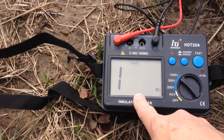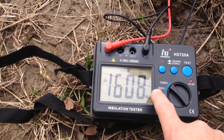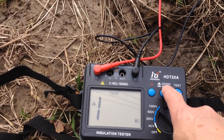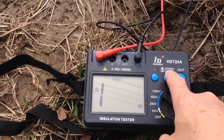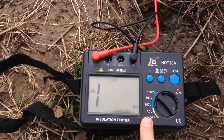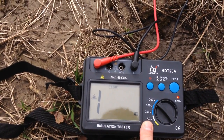This is a 1,000-volt unit, and when I go under test, the little red light comes on. It initially charges the line, so I have in excess of 2,000 mega-ohms — we're talking giga-ohms of resistance — which tells me I don't have a short on the line anymore.